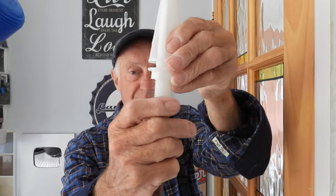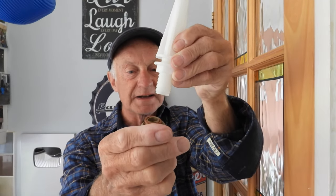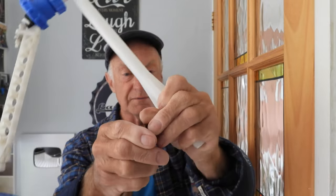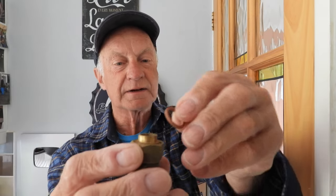That's probably because it's got a fiber washer in there that's split or worn flat. Here's a new fiber washer I've just put on this one — I'll get it off to show you. There it is. Basically, put a new one of those on there and the job's a good one.